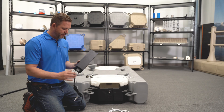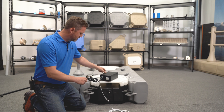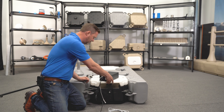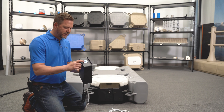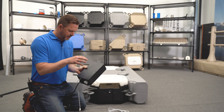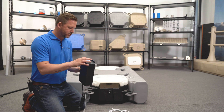Once it's there, the next step is to plug it in just to make sure the power unit works correctly. I'm going to plug it into an extension cord, and just by plugging it in we can see it's working — there's a bluish-purplish light on top which means the controller is on, so the converter receives the AC, converts it to 12 volts, and powers the controller.